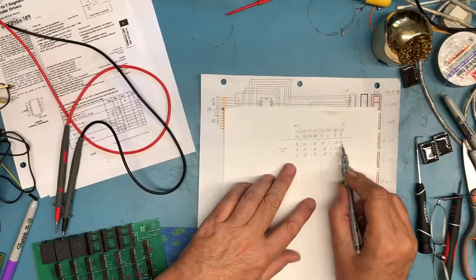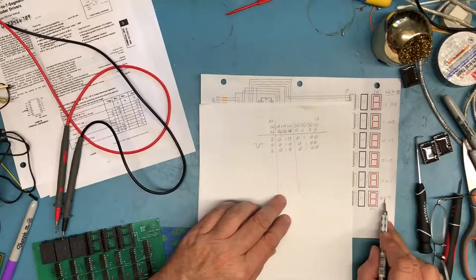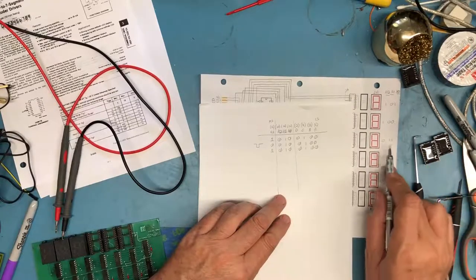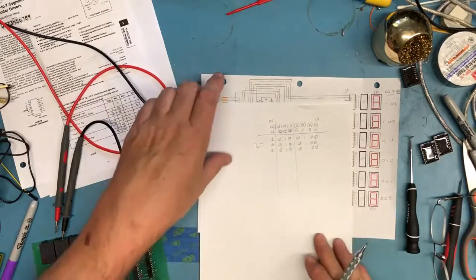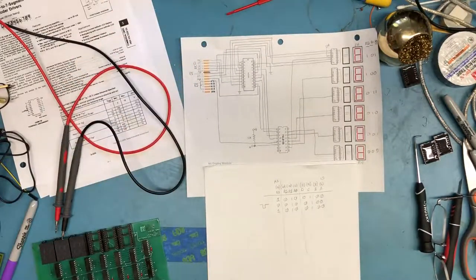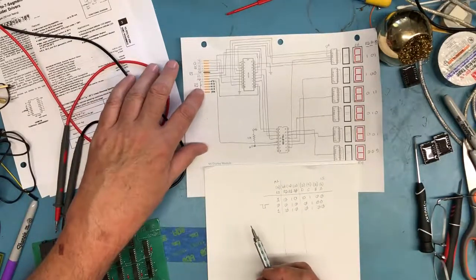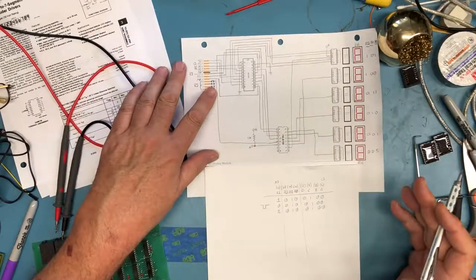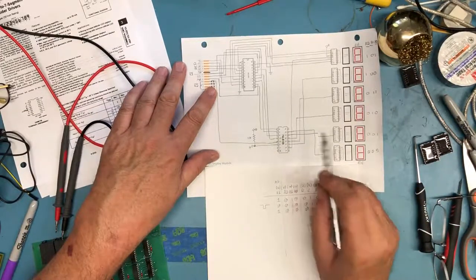I can output the BCD value I want on these 4 bits, the address of the display I want from 000 to 101, so again 0, 1, 2, 3, 4, 5. And I can use the most significant bit simply to generate the clock signal or the latch signal to latch it in. I think that's all it will take to actually drive this board. In this case, I would just simply ground this E2, jumper this to ground. The board's always enabled that way. That's fine, because enable 1 is normally high, there'll be no active outputs here.